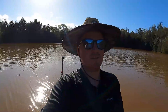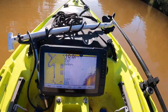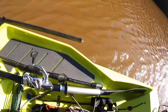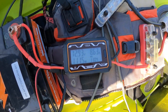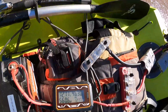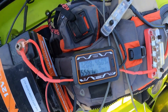Back out with the 11x6 propeller — same test as the others. At 2 miles an hour into the wind pulling 35 to 36 watts; away from the wind at 2 miles per hour pulling 23 watts. At 3.5 miles an hour into the wind pulling 110 watts; 3.5 miles per hour away from the wind pulling 115 watts. Full throttle into the wind on the 11x6: 5 and a quarter miles an hour pulling 560 watts. Full throttle away from the wind: 5.4 miles per hour pulling 555 watts.